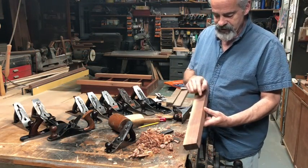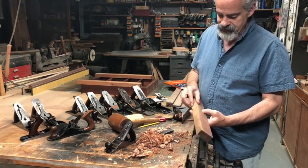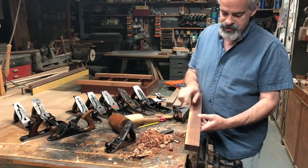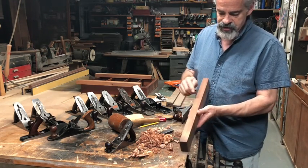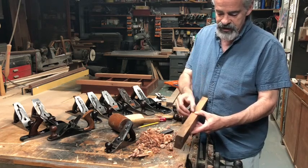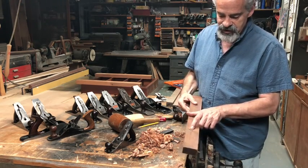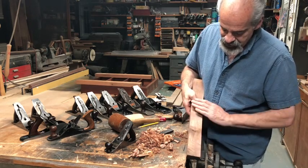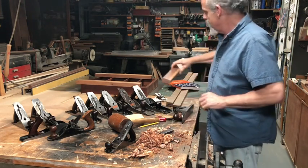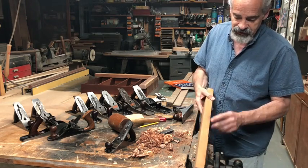I want to explain that this piece of walnut is for a door frame for the spice rack. I squared this one to this one because I'll probably cut some of this off. This is nice and dark brown — that's the piece I really want. I'm going to stop here and not go on to the other two sides because I need to thickness it down to the size of the door — I'll saw that rather than planing all of it off. This part where the knot is I'll probably be able to take off completely. Now I'll stop on this piece and start on another one — get one side good and another side good.